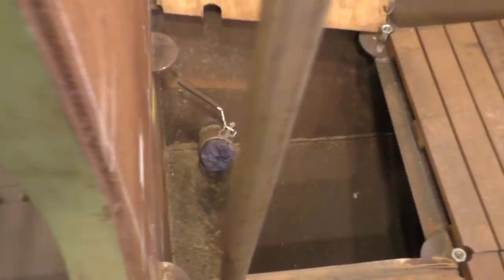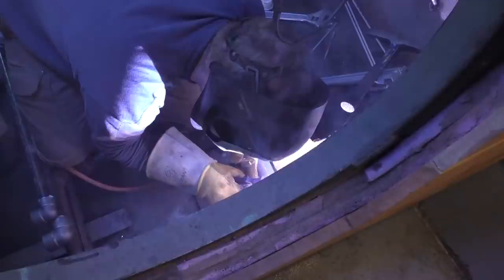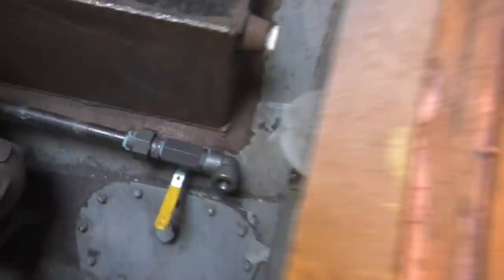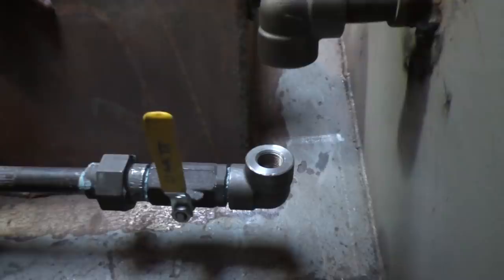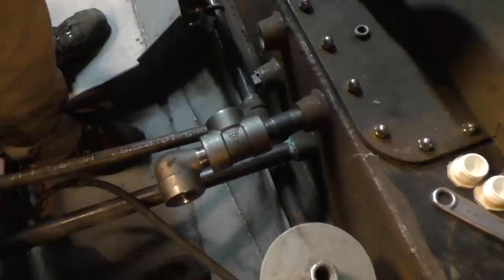This is the forward cabin - we've opened up the floor of our cargo hold all the way back to the engine room. A coupler gets welded into the bulkhead, and then there's a union on either side, and a valve. The valve shuts off the front end of the boat; the union allows you to plumb into this coupler. Every time you get to a place where you can't spin the pipe or fitting on, you have a union there to fix that problem. Nipples are hard to thread on the pipe vise - we're probably going to buy about a three-and-a-half inch nipple.